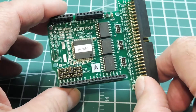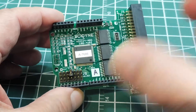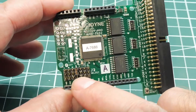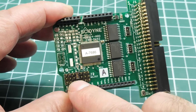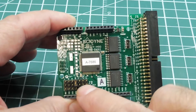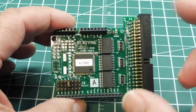The original I/Os on the Uno are still available through this header here. Now if you need more than 24 I/Os, you could actually stack another board on top — but you need a board select, and that's where this little jumper array comes in. You would assign one of the pins on the Uno to select or deselect this board; in this case it's jumpered for pin 10. On the second board stacked on top, you could assign pin 11, and you could keep stacking boards.